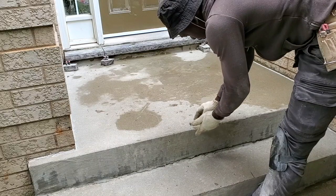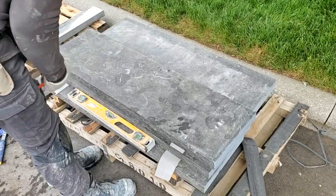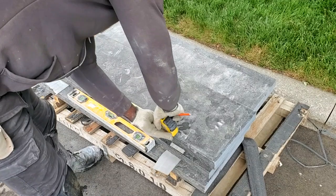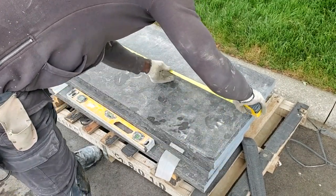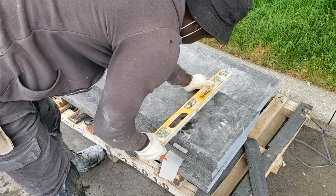But now that I have my marker open, I'm going to go ahead and mark this out right now. 3 feet, 3 inches, and cut it off. I'm gonna make the cut so that I have the cut section turned towards the wall. So now I'm just gonna measure from this area, 3 feet, 3 inches. Put another 3 feet, 3 inches over here. Just gonna score it across.